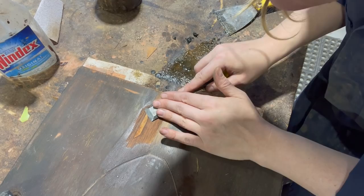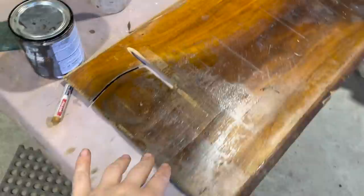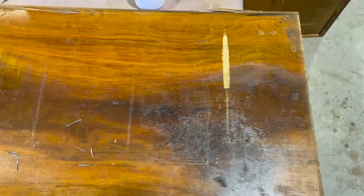Alright guys, so I've got the bottom drawer apart that was in pretty bad shape and had all the blue tape on it, and we can see why. These super deep grooves that are usually just grooves on this drawer bottom have gone all the way through, and I'll show you the culprits. And I hate these types of drawer stops. You've probably seen them before. These are drawer bottom eaters right here.